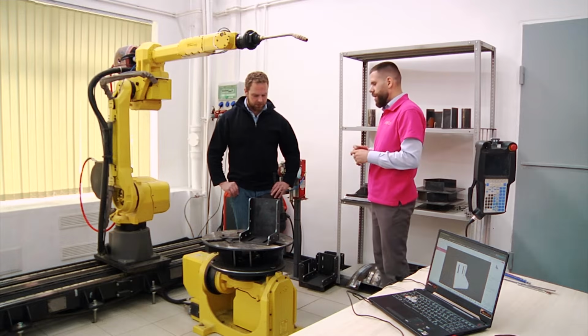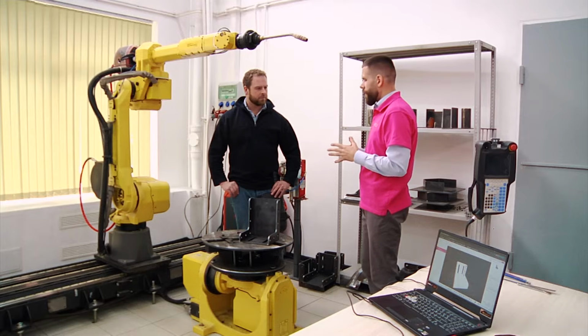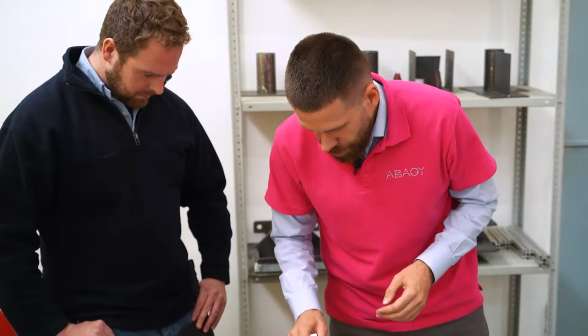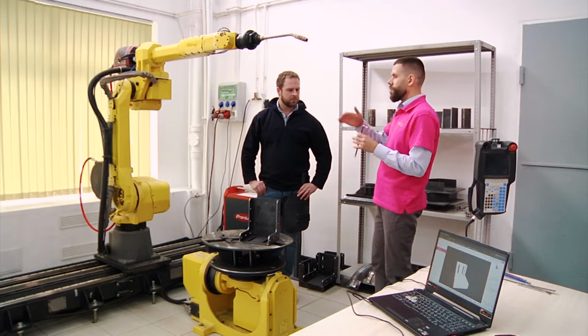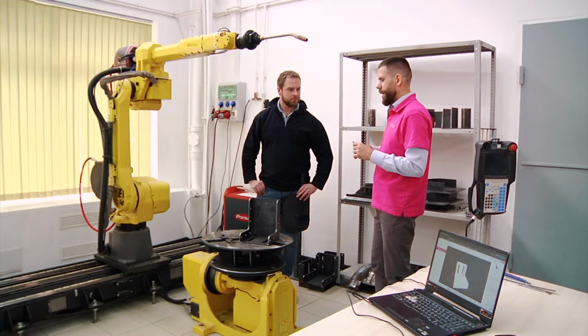The second way is impulse welding, when we do the welding with a different power interval. At first we make the power big, and then a lot of metal floats out. But in order for the metal to hold in position, we reduce the power, so it will cool down. This way we may achieve the same situation for the metal not to flow down rapidly. I hope that we will show you both of the ways today, and also the straightforward way to make the seam without any fancy techniques. And we will see that it will not be that good, okay?